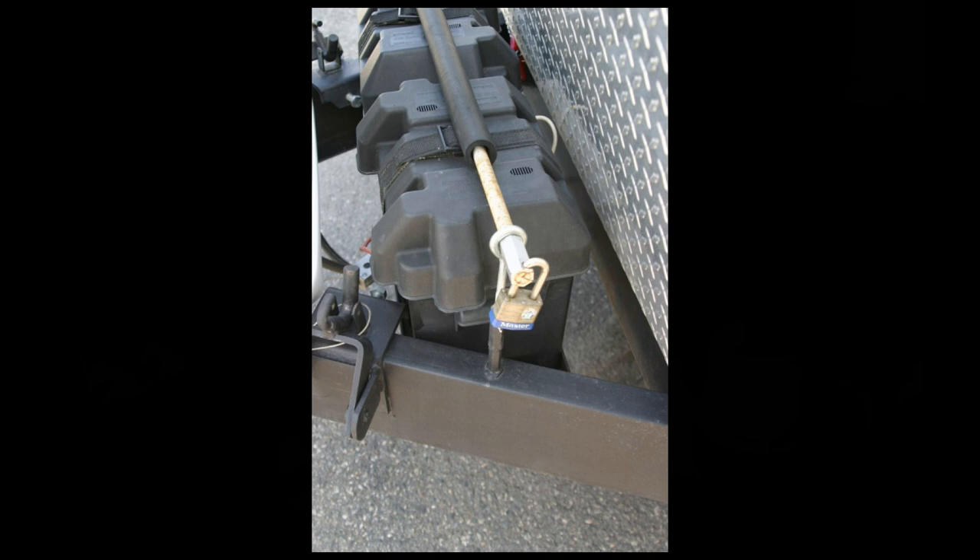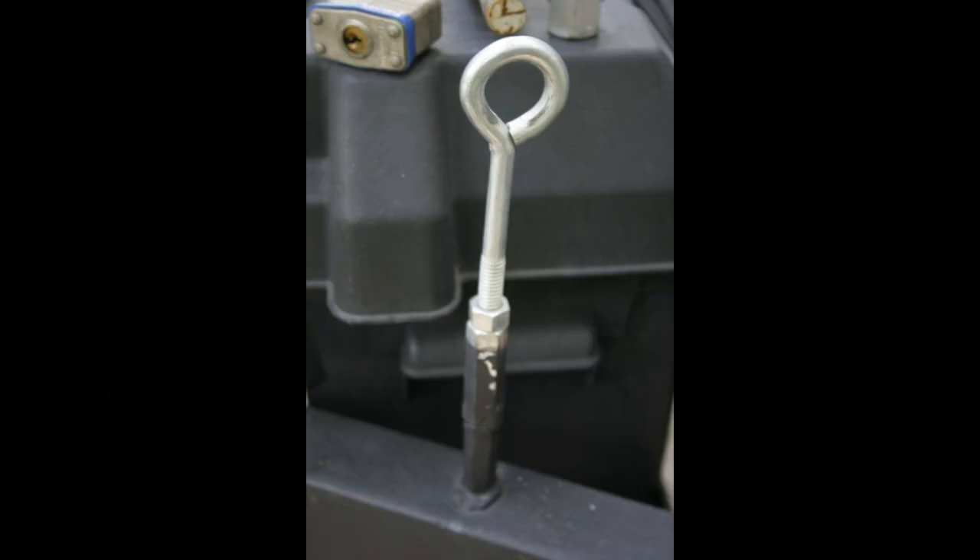The first thing I had to do was secure some sort of rod anchor. What I did was weld a couple of deep nuts right to the frame and then threaded in my rod. Looking back, I probably should have bought a long eyebolt and fastened it in one piece all the way down, but this is what I had the day I made the project and it worked just fine. You need to fasten some sort of ring or eye hook to your frame that you can run your rod down to hold your batteries.